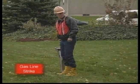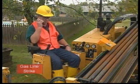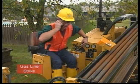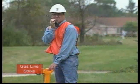If a gas line strike occurs, leave the area of the leak immediately. Inform the drill operator of the strike and remind him to shut down all engines. Also remind him that the drill string should not be reversed or retracted to break contact with the gas line, since any further movement could cause a spark that may ignite any leaking gas.